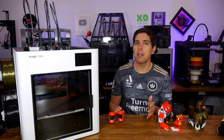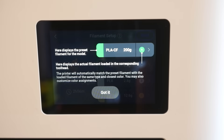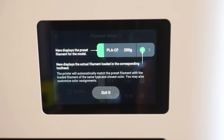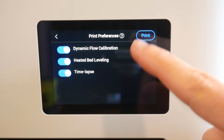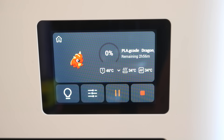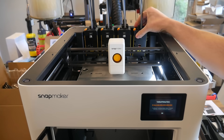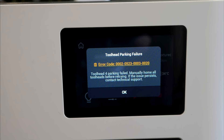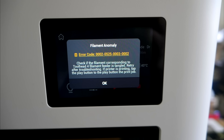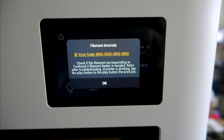Most people should be up and running in 90 minutes to 2 hours — quicker and easier than the Prusa XL setup. The final setup step is loading filament and printing a four-colour demonstration dragon using all tools. However, I had problems: my calibration sequence initially failed because the printer failed to stow Tool 4 back on its dock. I fixed this and ran calibration again, but the error recurred during printing and became more frequent. I also had a second error where Tool 4's filament wouldn't load — even feeding filament manually to the nozzle, the printer refused to acknowledge its presence. All my initial test prints were done with only the first three tools.